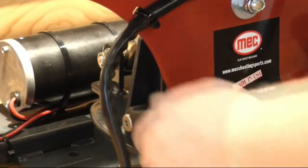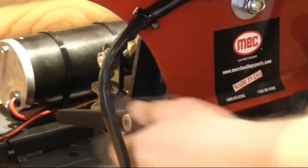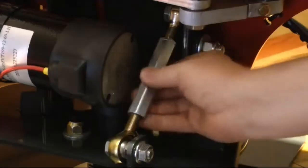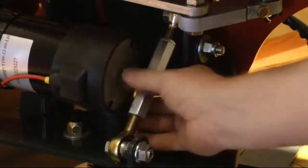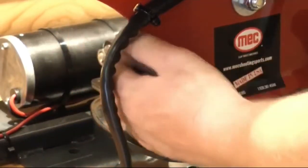To adjust the tilt of the 300E ATA, undo the locking lever at the rear of the pivot plate assembly. Rotate the turnbuckle to allow the machine to tilt. Retighten the locking lever.